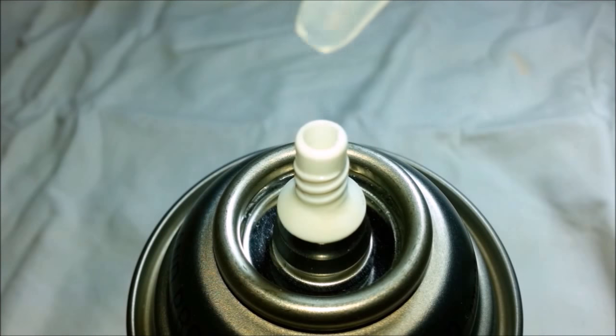This is another video about polyurethane foam, also known as Great Stuff Foam. In this video, I'm going to show you how to keep the valves from stopping up using castor oil and mineral spirits. That way you can use the can several times, even if you wait a few months in between uses.